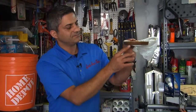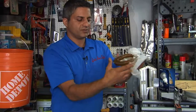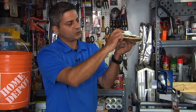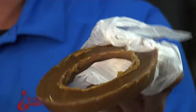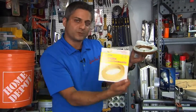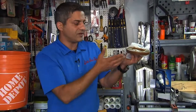This is maybe half inch thick and it's missing the horn. This will mount to the bottom of your toilet and then you install your toilet. Now, the same manufacturer Waterline also makes one that is approximately twice as thick. When it comes to wax, size does matter. You want the thick one, and with the thick more expensive one, it has a horn on it — a black plastic flange that assists to make sure that your waste goes all the way down the drain. So again, not to disrespect Waterline because they make the thick one that costs maybe $6, and then they also make the one that costs about $1.29.